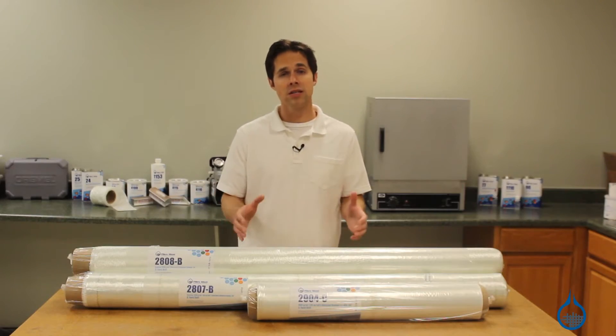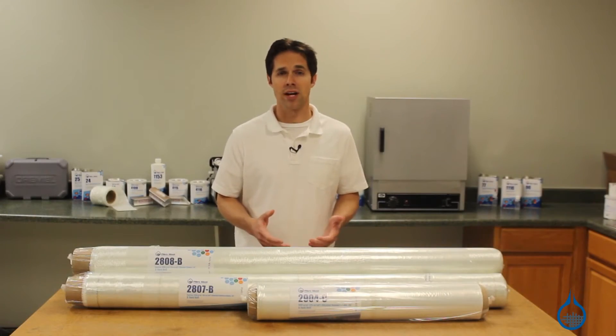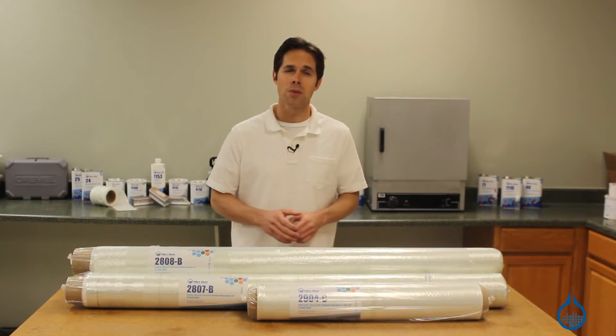stitched fabrics are ideally suited for selective reinforcement. Fibers are bundled and stitched together rather than woven, so there is no crimp in the yarn. As a result, parts made from stitched fiberglass have optimized directional strength, good resilience, and a unique ability to absorb forces like pressure and tension.